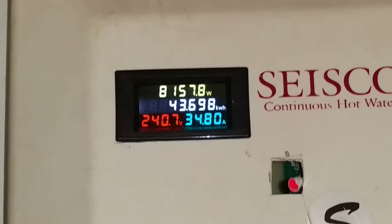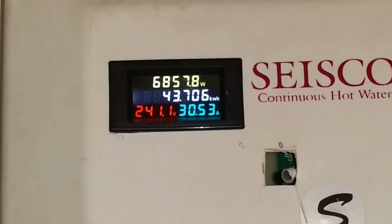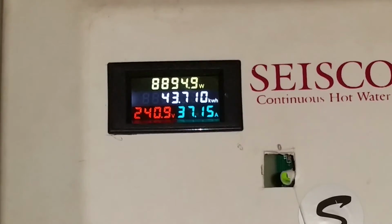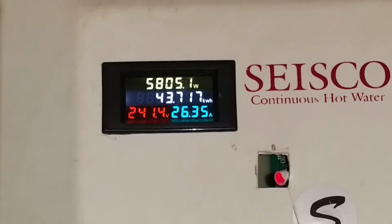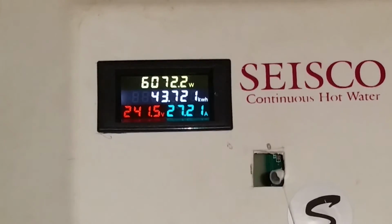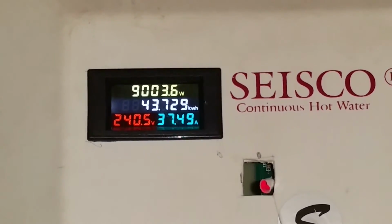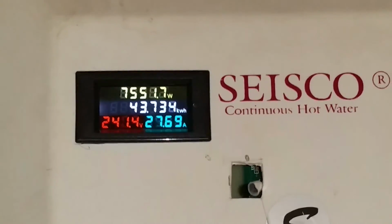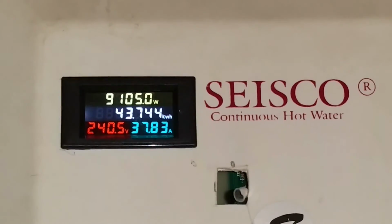With the amount of flow we have, we'll probably end up at around, I'm going to guess, 15–20 amps maybe, as it modulates the four 4,500 watt cells in there. Although our water temperature's dropped a little bit for winter here. It's usually about 80 degrees, 85 degrees in the summer, and now it's probably down to 65 here in Florida.